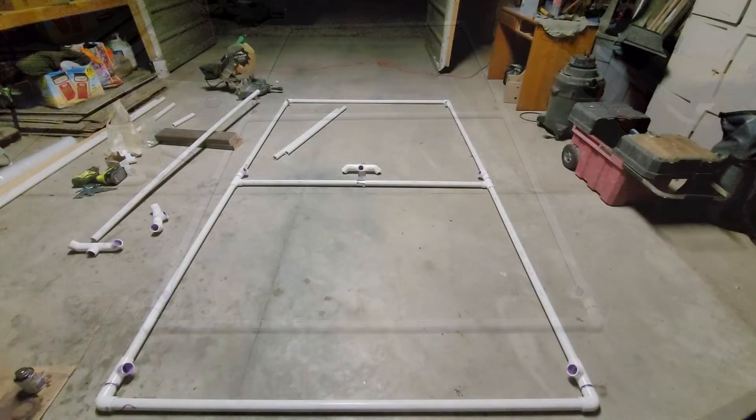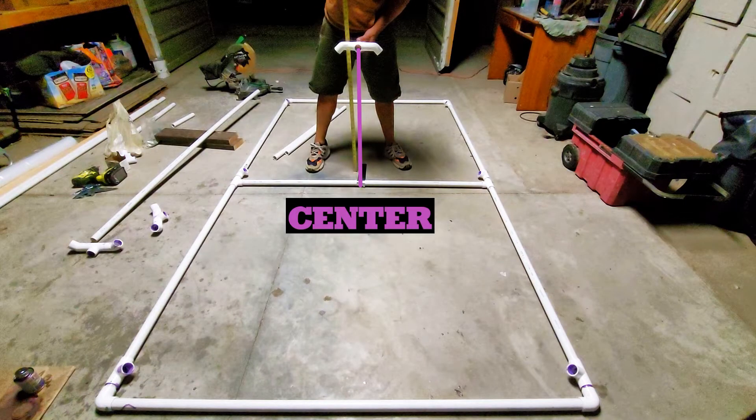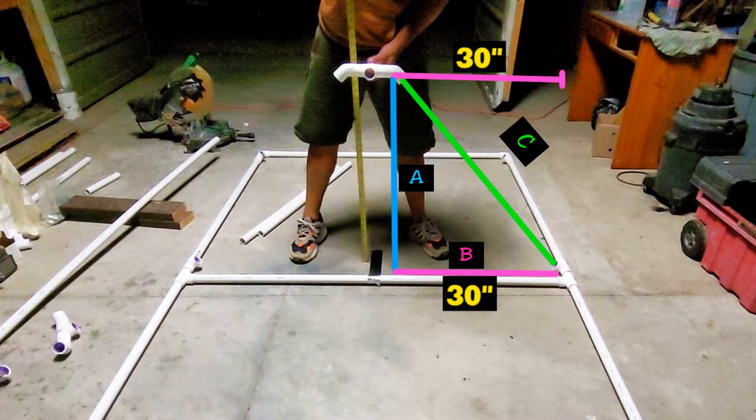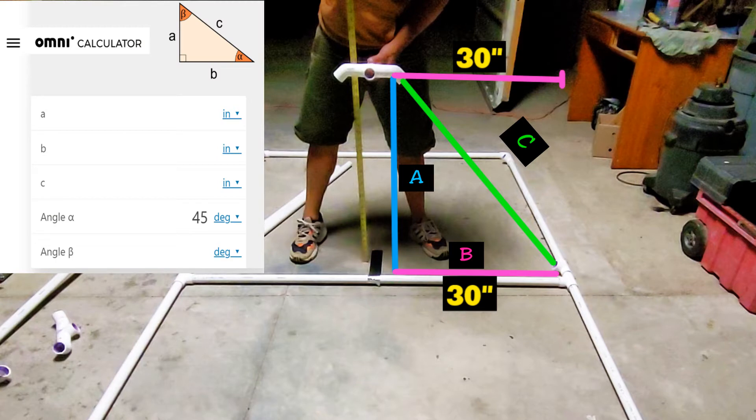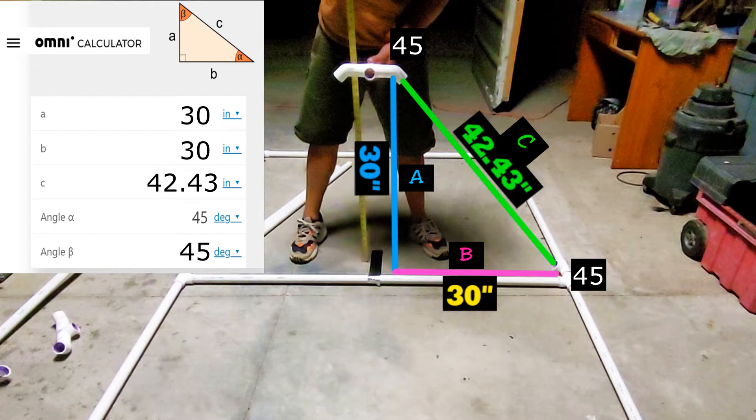I'm going to wait to glue anything else together until I get all the angles lined up properly. Next, it's time to grab one of the tees or cross from the top portion of the frame and line it up with the center of the bottom of the frame. Then I will measure the horizontal distance between where the angle begins on the top over to the edge of the bottom of the frame, which on mine is approximately 30 inches. With this measurement, you can use a right triangle side and angle calculator. Since the top corner angles are 45 degrees, I will match the bottom with the same angle. If I type 30 inches in for side B, the calculator shows that the top of the frame or side A will be 30 inches high and the distance on side C from top to bottom will be 42.43 inches. So I need six pieces of pipe cut at this measurement — I can round this up to 42 and a half inches. It would be a good idea to just cut two pieces to start with, then do a test fit to ensure everything fits, then continue on.